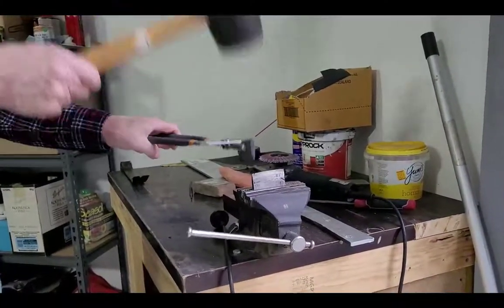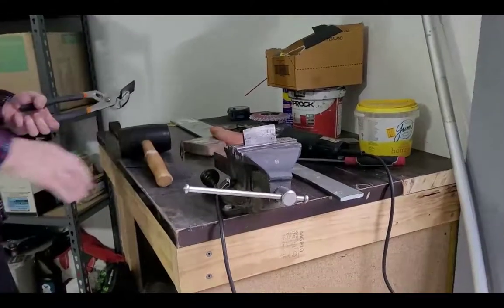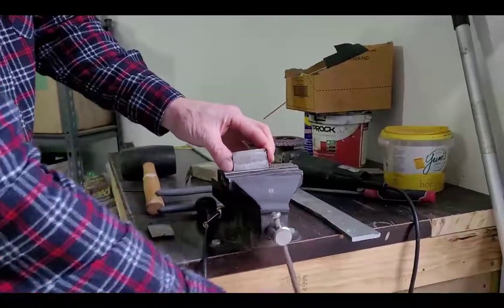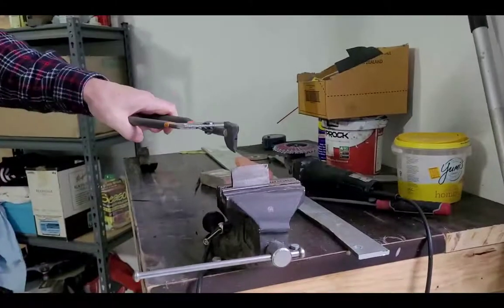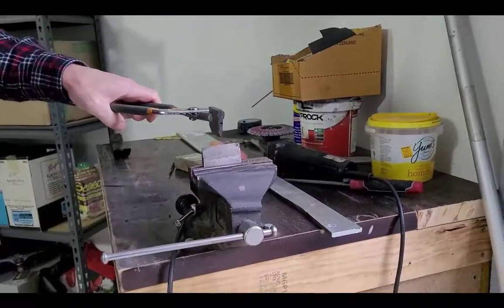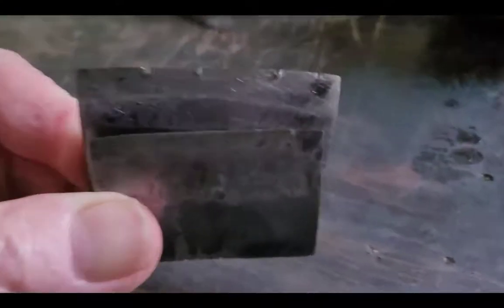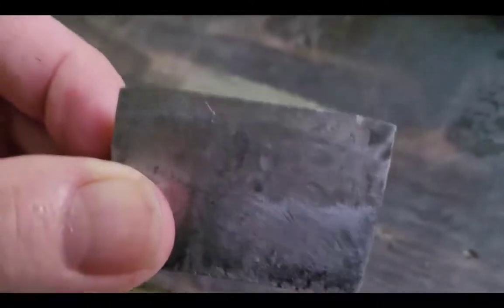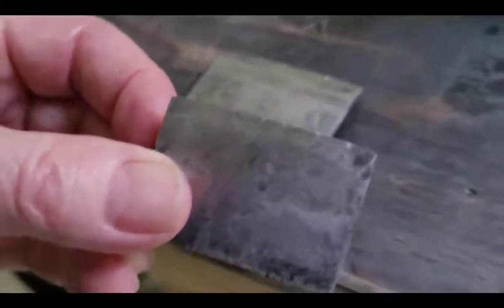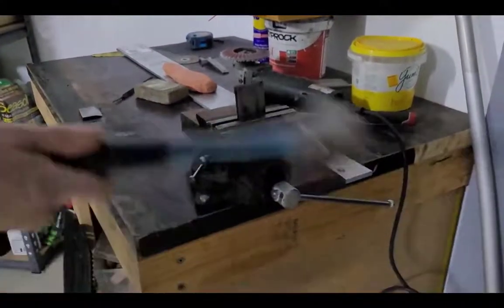But the real test is whose sword will win in battle — because nobody is going to bring a file to a sword fight. To test this, I needed a way to bring one blade down hard against the other in a controlled fashion. I did that by putting one piece in my trusty vise, holding the other with vise grips, and then using a rubber mallet to cause a collision. And just in case it somehow mattered which one was in the vise, I swapped around the samples to approach this whole test in a scientific manner. And frankly, I was shocked by the result — in a good way. The control sample has deep gouges where the two edges collided, while the carburised edge is barely scratched. In fact, I can drag my fingernail along it and there's no dent in the edge at all. But would our carburised sword have snapped in the midst of battle? Well, let's try the whack-it-with-a-hammer test. It seems that because the core of the blade is still flexible steel, it resists a strong blow with the hammer.